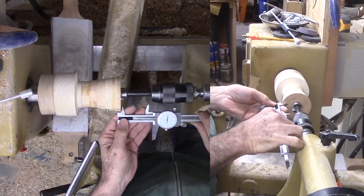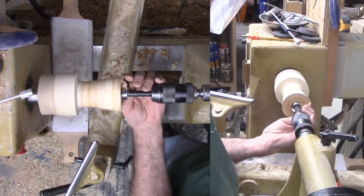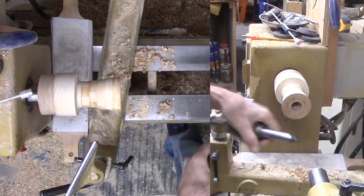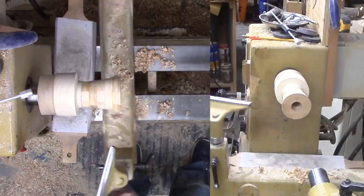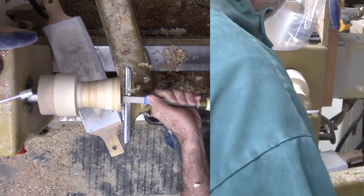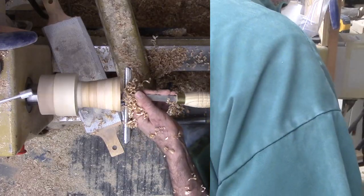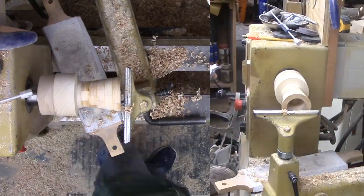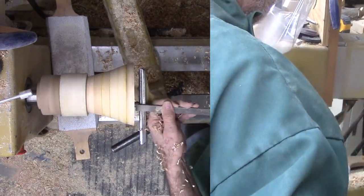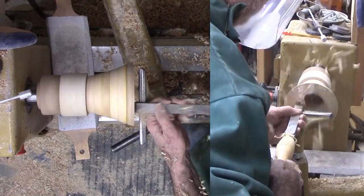Each stack has now had several hours to dry in a warmer environment — I cannot trust glue to dry well in the cold shop. I now have the bottom section ready to hollow. To minimize stress on the fresh glue, I will drill out to the smallest target diameter, then expand with a box scraper. All pressure is back into the headstock. Even then, there are signs of semi-dry glue, but that is okay. For the midsection, a box scraper will do the job since the walls are somewhat straight. I am not doing anything to the exterior at this point.